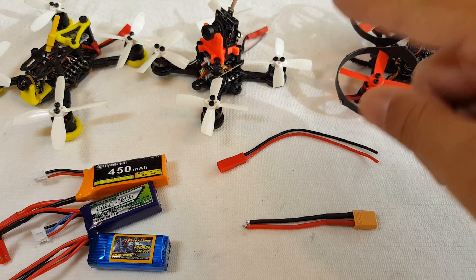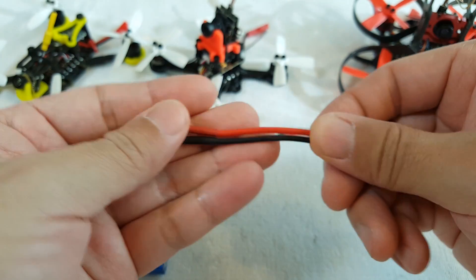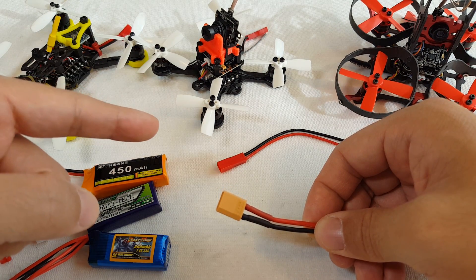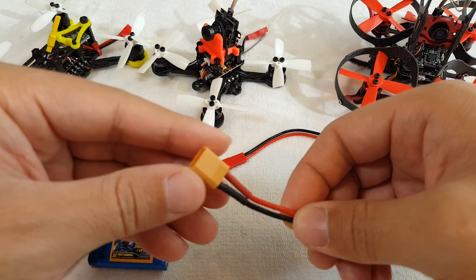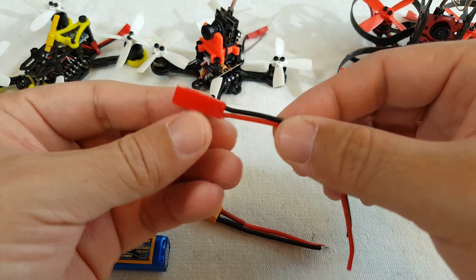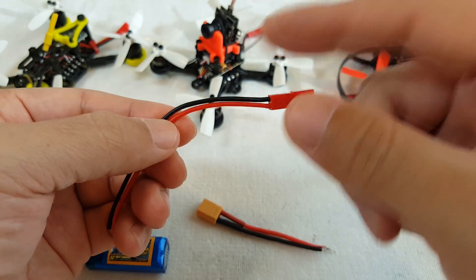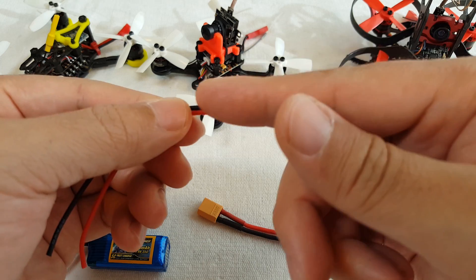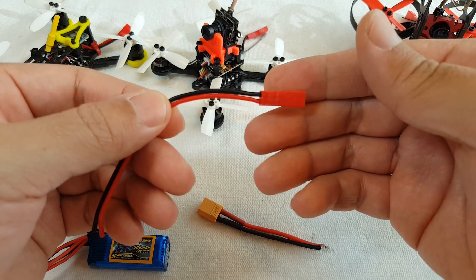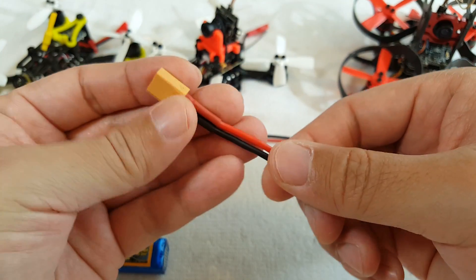Something a lot of people aren't aware of: there's a lot of people switching to these XT30 connectors, and I think they're probably doing it unnecessarily. The XT30 connectors are really only needed if you're running on 3S or 4S. For me, I'm only running these on 2S, so for that JST with 20 gauge is probably just fine. Even after flying really hard, the wire and the connector don't get warm at all. That's the thing that determines whether or not you need to upgrade — if it gets warm or hot, that means more current is flowing than the wire can handle, causing heat due to resistance.